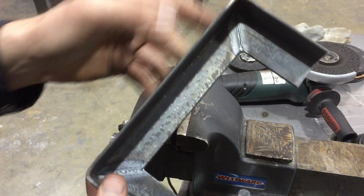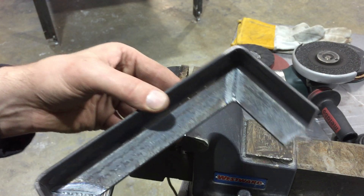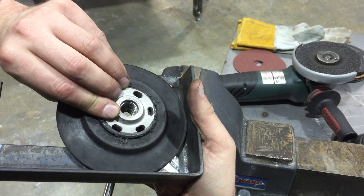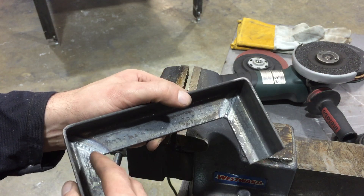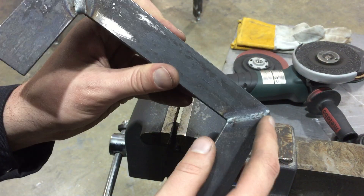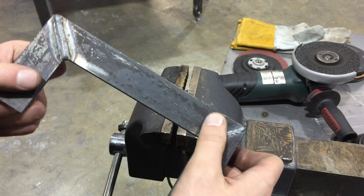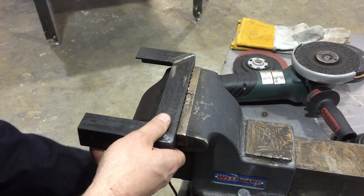Once you have a good weld — MIG versus TIG — you've got pretty decent penetration on both. A question I often get is: if I put a weld in an inside corner, how do I grind that flush? Generally speaking, you just don't, because there's no way to get a grinder in there easily. You can try a die grinder but it's just going to look pretty chewed up. You may just want to avoid welding in there, or lay in a really neat weld and leave it. If it didn't need to be super flush, just leave the TIG or MIG weld as is.